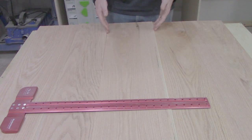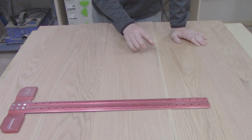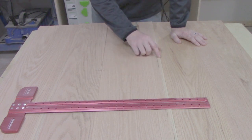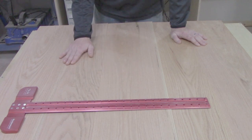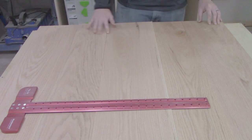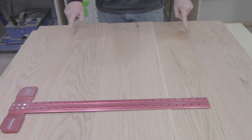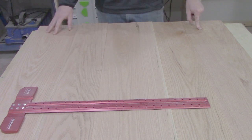If the client wants it to have that planked look, it's a very simple fix. Once you get all your boards together and everything lines up good, you can take a router with a round-over bit and do an ever so slight round-over edge on each one of these joints. It won't change the way that your boards glue together, but it will give it that look of planked boards, and some people like that. Looking at my five boards that make up those 41 inches, the middle board is a 10-inch board, the two on the outside of that are 6.5 inches, and the two on the far outside are 9 inches, totaling 41 inches. I do this because it breaks up the monotony of every single piece being exactly the same width and just gives it a different look.